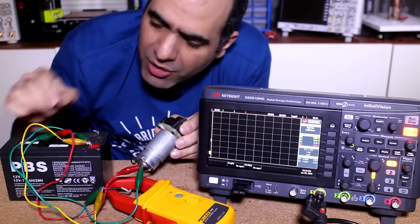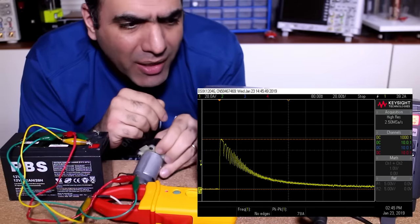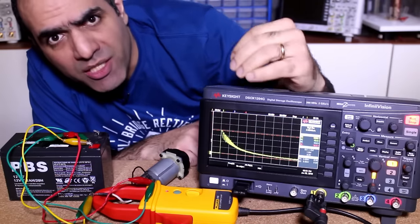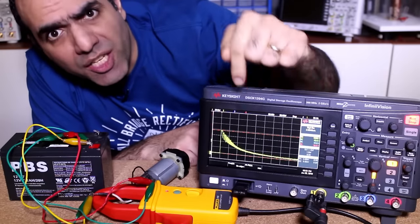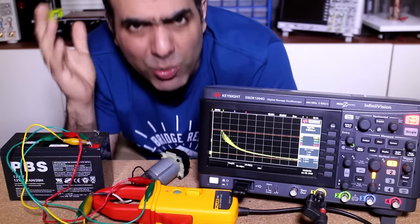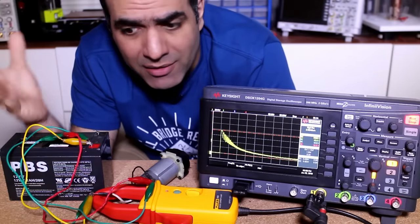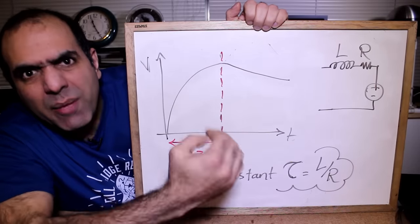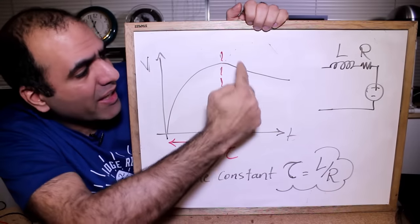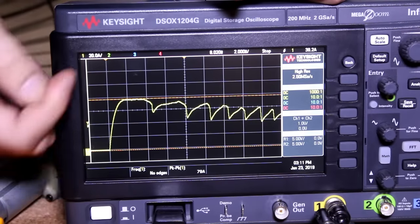Let's start a motor using a battery and measure the current on the scope. The current spikes to around 80 amps even for this tiny motor, then drops to around 3 amps. At the beginning there is no back EMF to lower the current, and the current drops as the back EMF rises with motor speed. This initial spike is called the inrush current. Motors like engine starters draw over 200 amps of inrush — we had a motor at work that would draw over 800 amps of inrush. This imposes a huge startup challenge for systems that can't handle this much current. The motor has a series inductor, but the electrical time constant L/R is very small — in milliseconds — much smaller than the mechanical time constant.